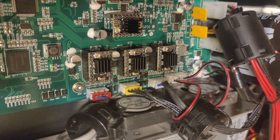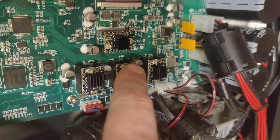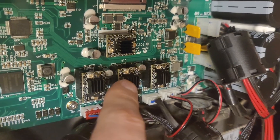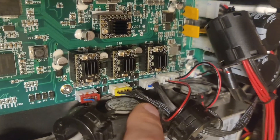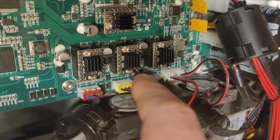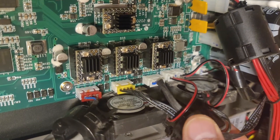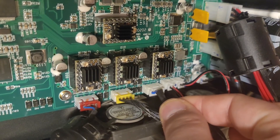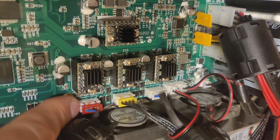Let's talk about what you have to do here — both flipping these connectors around and also tuning up the pots to the voltage. These are the connectors I'm talking about where you have to pull them out and reverse them. You have to disconnect all three of them. You also have to move your motherboard out of the way if you haven't before. Pull these out and take your pliers to pull these connectors.